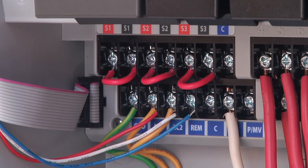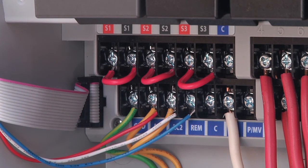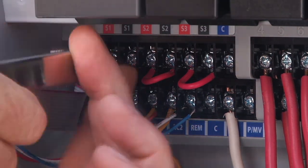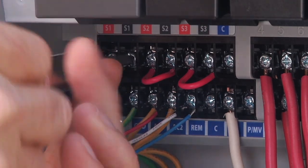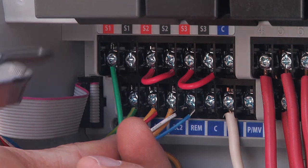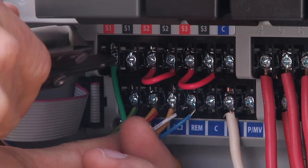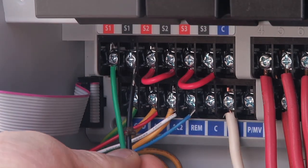The sensor or sensor receiver is connected directly to a set of sensor terminals in the wiring cabinet — S1, S2, or S3. The order of the wires does not matter. It is important, however, that you remove the jumper that connects the two screws. Also, if no sensor is connected to one of the terminals, the jumper must be left in place.